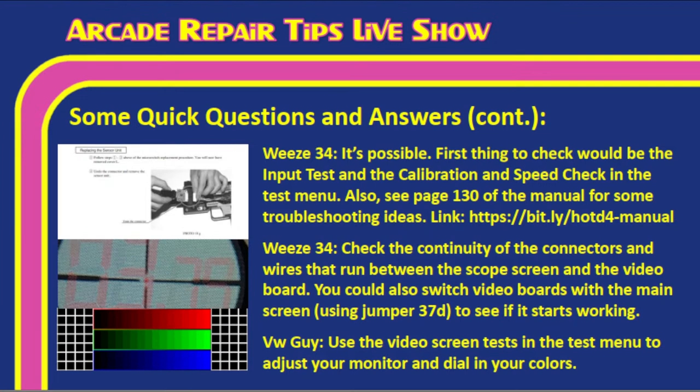Very good. And then VW guy, okay, sounds like a monitor adjustment, right, Tim? Mm-hmm. So let's use the video screen test in the test menu, which pretty much every Golden Tee has, and let's adjust the monitor and dial in your colors based on that screen. If you do that, that'll help you out a lot. Now, if it's still quite yellow, it could be a bad tube. It could be some other issues.